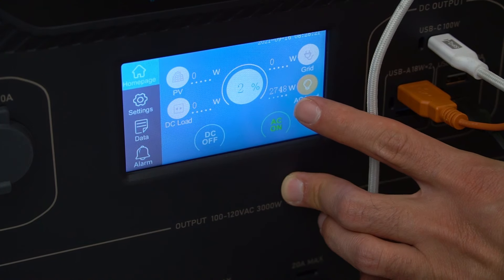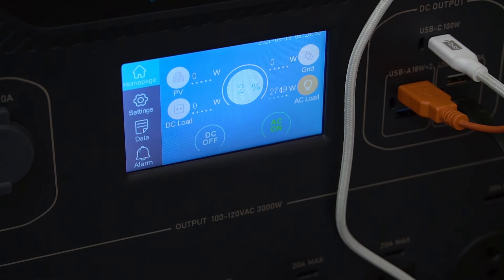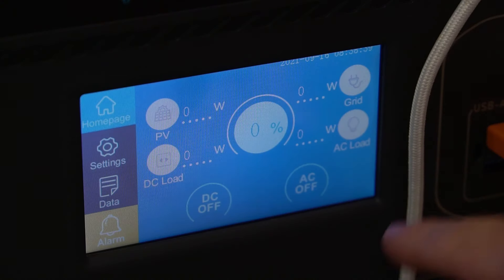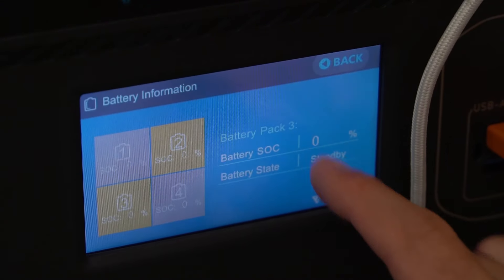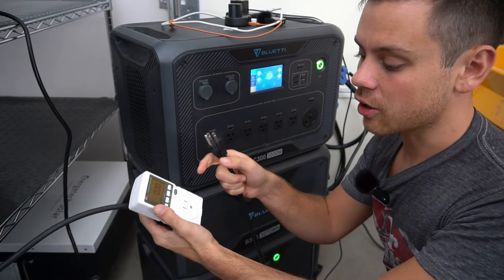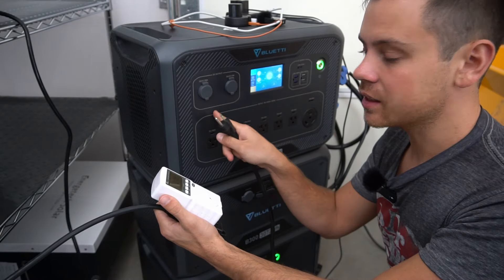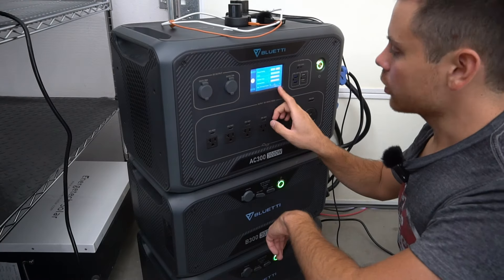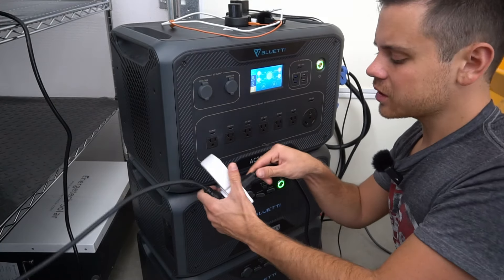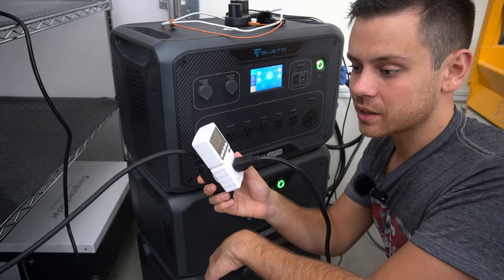We're running a battery charger and a heat gun, pulling 2700 watts all the way until it's at zero. I'm a little salty that this unit is not working well for other YouTubers because I actually really like it. We just got low voltage disconnect and we're at zero percent state of charge. Now we're going to charge it with the AC charger and a watt meter, measuring how many kilowatt hours it takes to recharge both batteries. We're charging at 12 amps, which is about 0.4 to 0.5C, so we'll come back in about five hours.